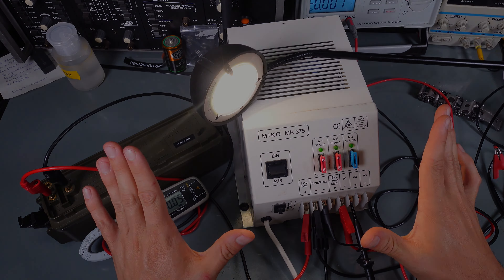Of course, the ripple only matters for sensitive equipment — when you've got a halogen bulb it absolutely does not matter. I've got my true RMS meter — I grab the negative and connect it to the block and any of those ports are going to read a correct almost 13 volts, which is okay. As you can see everything is working fine. The stabilized output is reading a little bit lower — not perfectly okay for a 12 volt range. So this is how you connect your Miko MK375 to work with a battery and main AC. You were able to see how it transfers and prioritizes AC over DC. Thank you very much for watching — I hope you find it interesting, see you next time, bye bye.